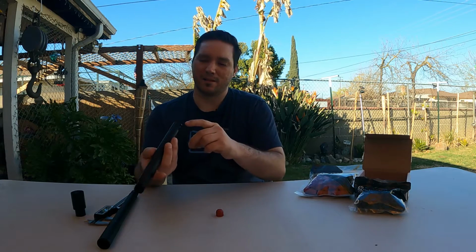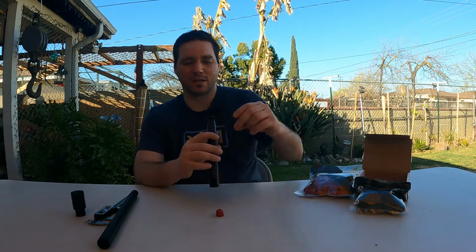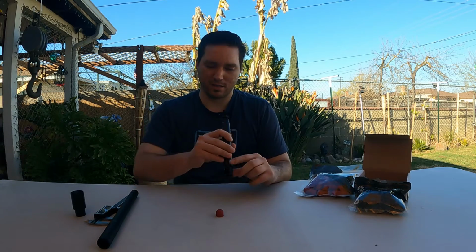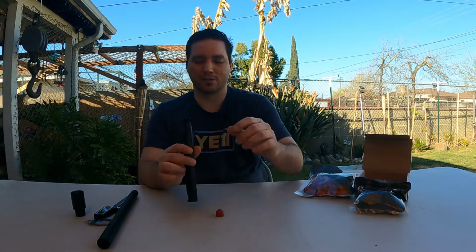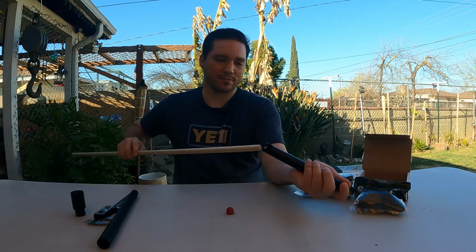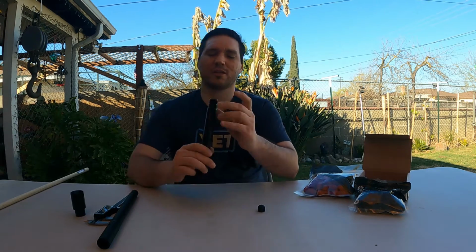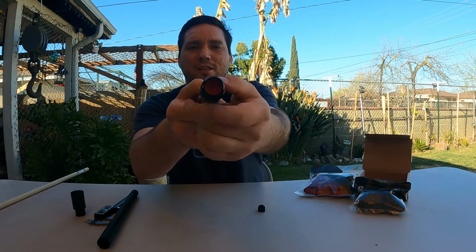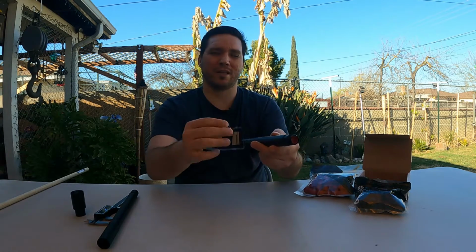Okay, and this, the little fingers will touch, so the projectile won't be allowed to slide in as easily. Okay, so that dropped in. Okay, there's a little bit of friction in there. I don't know if you can see that. I'll try to get an up close image of that. All right, let me push it out with my dowel. And then now let's check these. Okay, the shaped projectiles, the first strike style, they start gaining friction at the very beginning, okay? Whereas the Grimbergs, they kind of drop down about midway before they gripped. And these are already gripping, okay?